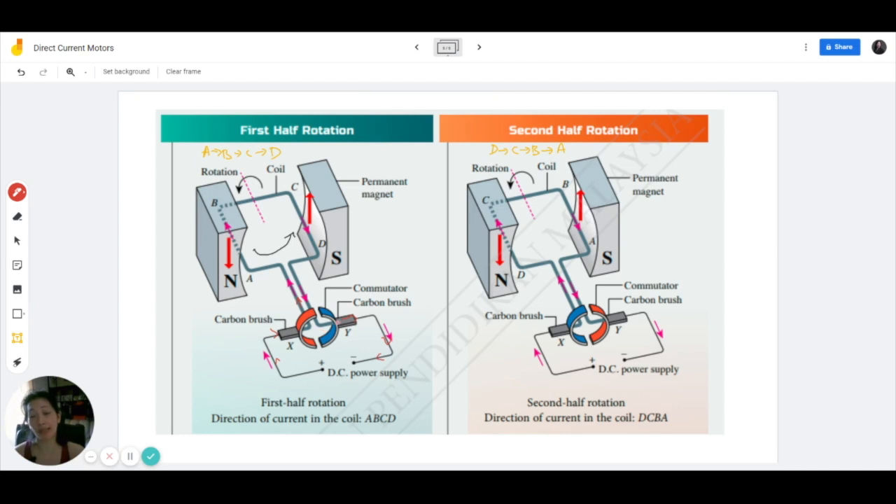Just to point out again, the colors of the commutator are not important. They're not magnetic, they're not north and south. The reason why the visuals are colored this way is to show you how the exchange takes place — red was initially on the left and blue was on the right, and now they've changed places. Also, a question some students ask is what happens when the break in the commutator reaches the carbon brush — wouldn't the motor also stop rotating? While it's spinning there may be a brief moment where there's no current flow and hence no force, but inertia makes it continue to rotate, which then causes the commutator to come in contact with the carbon brush again and continue its rotation.